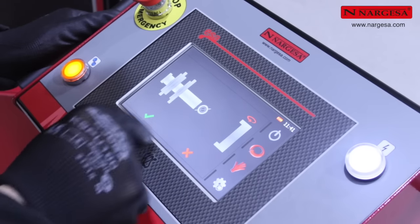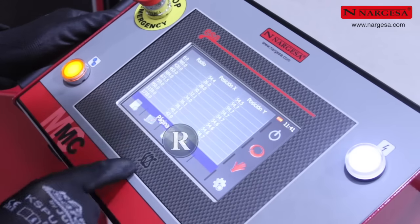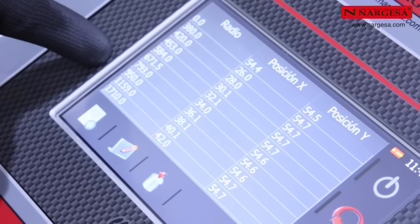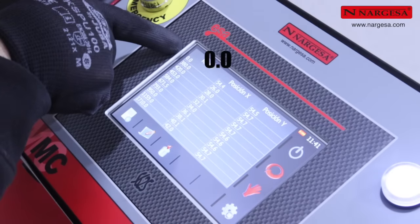Use the same roller configuration and contact point for the lower axles and check the radius database created before. You want a bend radius of 950 millimeters. You know the clamp position is at a reference of 54.4.